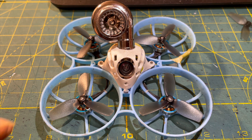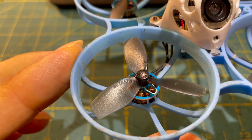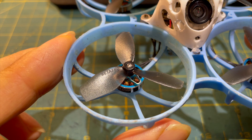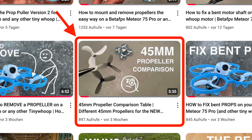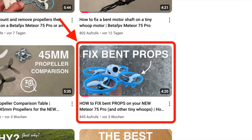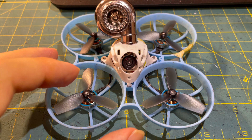One of the simplest modifications is the propellers. There are now a few options in the 45mm size. I don't really like the stock Gemfan 45mm propellers because they are prone to prop wash and bend relatively quickly in a crash. My favorite for outdoor freestyle racing is the BetaFPV 45mm propeller, and the best for indoor racing is the HQ Prop 45mm. Check my other videos on propellers — links are in the description.